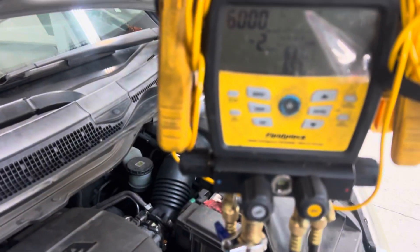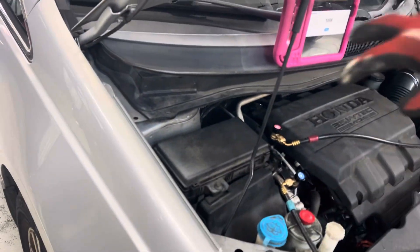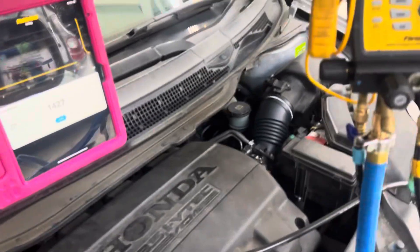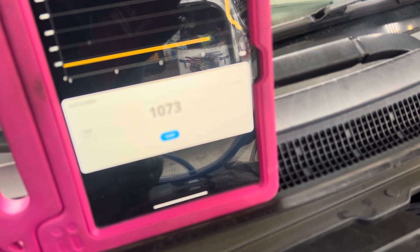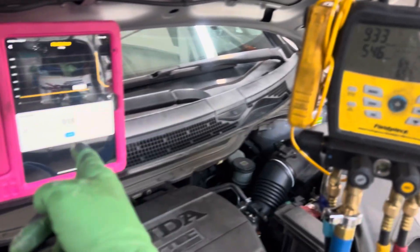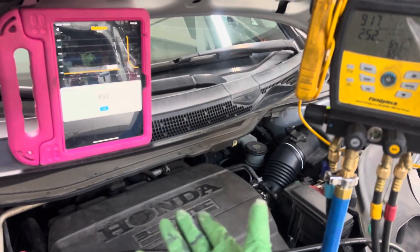So where are we right now? We are going down to 4,000 — 3,000. This is a very large dual evaporator with a lot of refrigerant line going all the way to the rear quarter panel and back, so it takes a little longer than a car. We're approaching where we leveled out during our vacuum decay before — that was 840 microns. I'm not going to let this run unattended; we'll come back and take a second video snapshot because it's going to take quite a while.